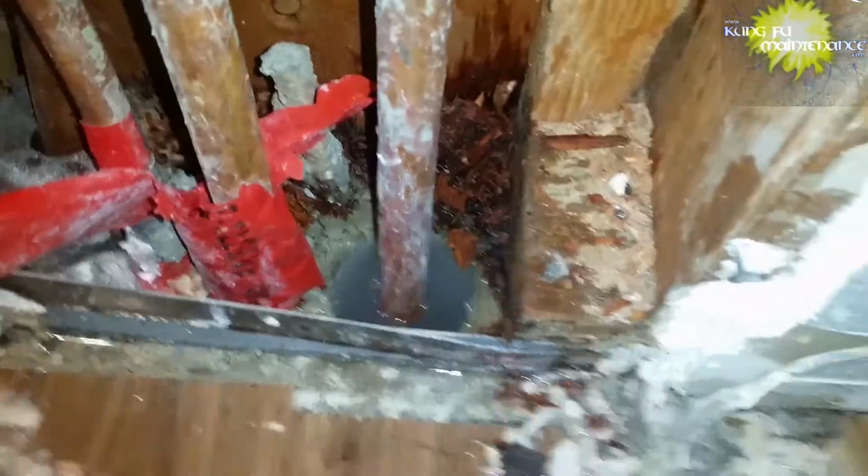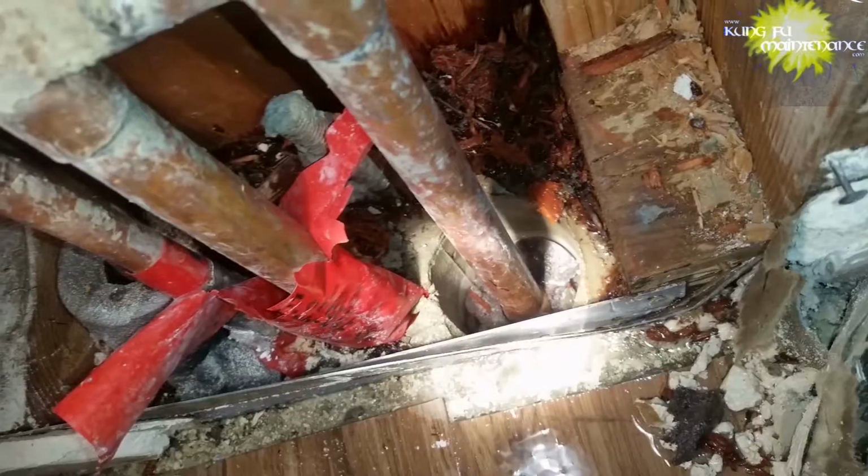And this was an end unit for multi-units, and so my thought is maybe the neighboring one would have shut off the water. I didn't try that. I'm actually going to go back and research that more. There's always more in situations like this, adding more to your knowledge, and this is something that I'm still looking into and developing. But I remembered a long time ago I had another end unit in a similar situation. I replaced the ball valve because the hot water wouldn't shut off, and that did not make it able to shut the hot water off. I had to shut the whole building off, and that was the situation with this one as well. So that's where it clicked with me that there's something different on the end units, and maybe it's just that the unit next to it shuts off the water to this unit. Again, I still need to figure that out.